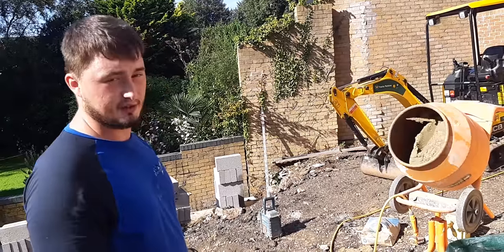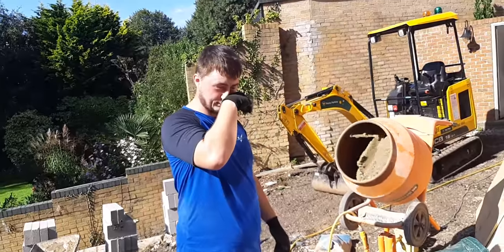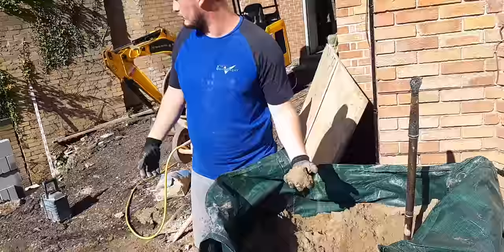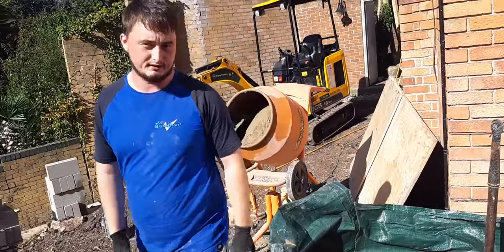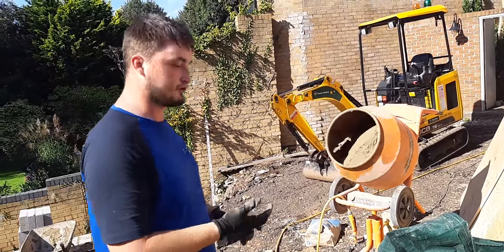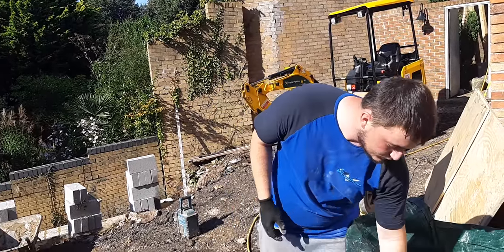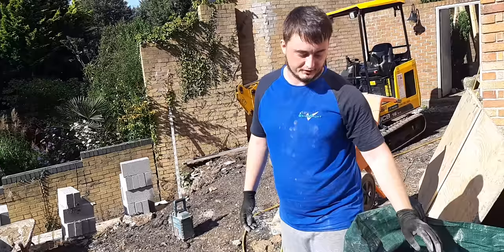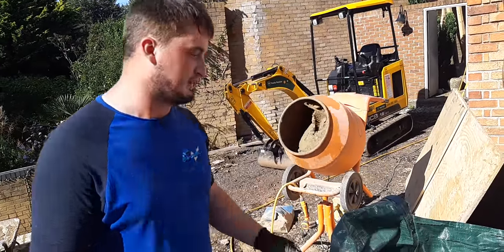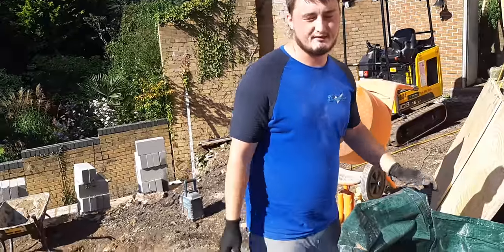It's just never going to work. So another question: what other sand could we use, and why would we change the sand? Well, obviously building sand is for building walls, blocks, all that type of thing — so for bricklaying, plastering, rendering. And then you can get sharp sand, which we generally use for screeding, for a drive, or laying patios. It's more gritty — it just holds well when you're doing a patio. But obviously you can't use it for block or brick, because it's got little bits in there like little stones, which you can't use — it'll stop you knocking your bricks and blocks down, and you'll just never be level.